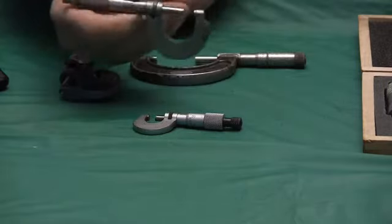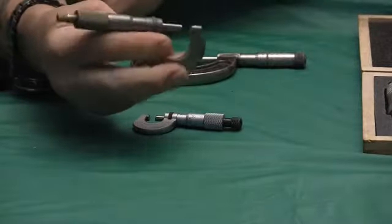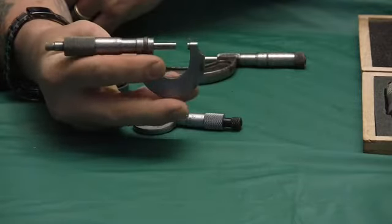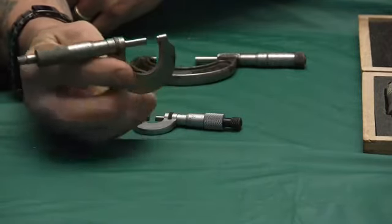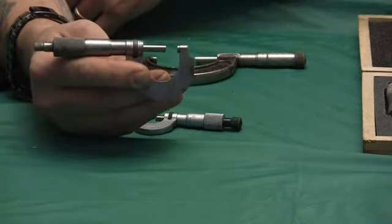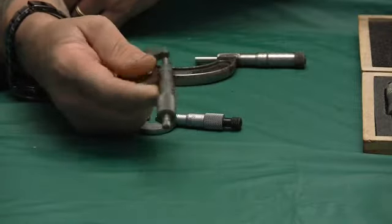Zero-to-one mics — if you're getting a little hobby lathe, this is probably one tool you should have. You could use dial calipers, but the micrometer for lathe work — measuring diameters — is the most accurate tool to use.